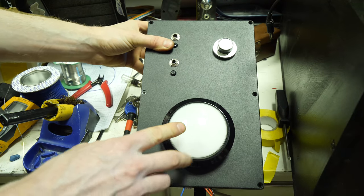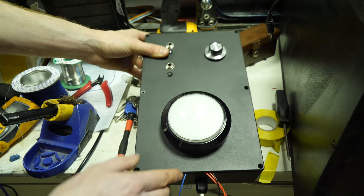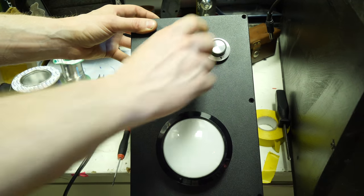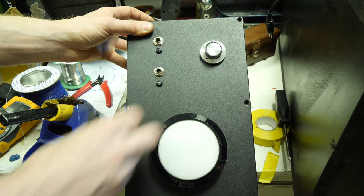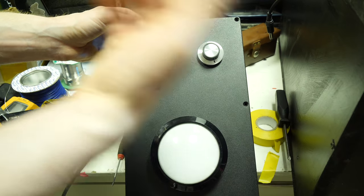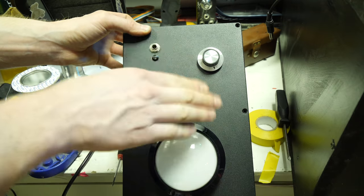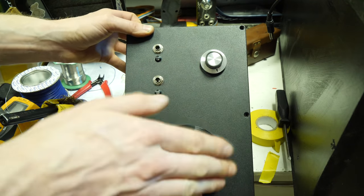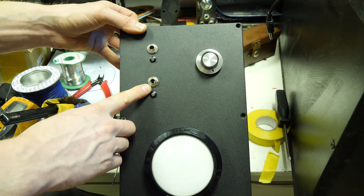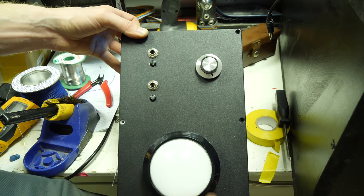What this button right here does is you push it, and it basically sends voltage to the coil to make the ratchet flick over. Also, it's got a speed control, so you can adjust the speed of the ratchet anywhere between a minute, which is the right amount, up to, I think, one every 5 seconds. And then it's got a trigger input, so you can also wire in something to sync it up, so you can bypass this and send in a synthesizer. It's also got a max speed choke, so it doesn't let it go crazy quick, but it can get reasonably quick. And then it's got the output, which is the output that would originally be the bell. At some point we'll build a bell interface to wire into this, so we can trigger a bell anyway.